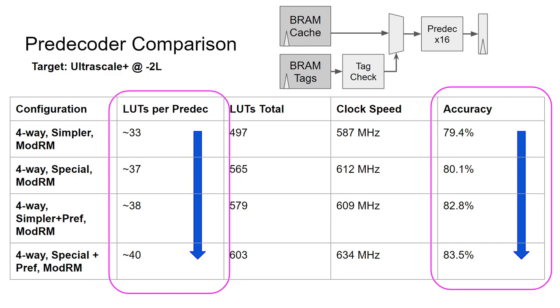Naturally, I didn't stop here when looking into implementing a pre-decoder, but it very quickly escalated in complexity when accounting for more of the pipeline. The solution ended up being far more complicated, which interestingly appears to be much closer to what Intel actually did after reading through a few patents. While that was able to achieve a slow corner clock of over 400 MHz on an Ultrascale Plus -2L speed device, the IPC performance, resource usage, and maintainability make it impractical. But that's a topic for another video or three, so I will leave it here for now. Anyway, hopefully you found this interesting. Thanks for watching.